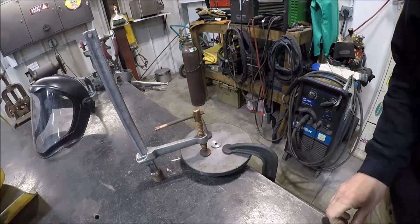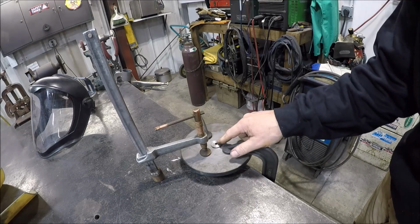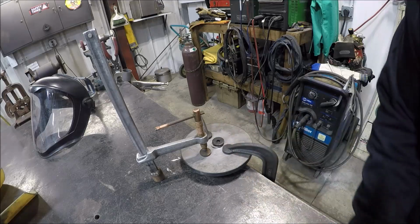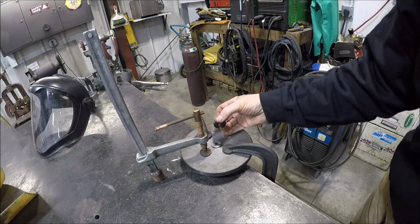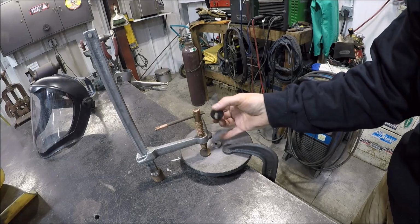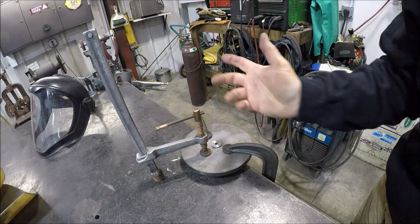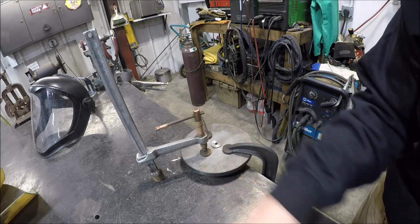So I was thinking about it, and let's scratch drilling that final tap size and threading it, because I was going to put a washer and a bolt to retain this, just as added insurance, since we're going to press fit it and pin it, you know, just to make sure it didn't come out. But since we're going to weld it, we don't need this, right?